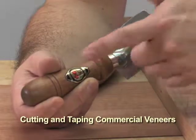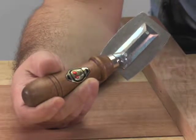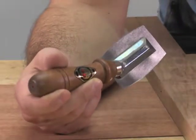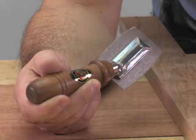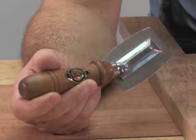This is called a Two Cherries — that's the brand — veneer saw. You'll notice it has curves on the blade. That's meant for when you're cutting; you kind of rock the saw so that you're using the teeth in different areas. This saw will cross-cut with no problem, but because the teeth are a little bigger, I like it particularly for ripping.